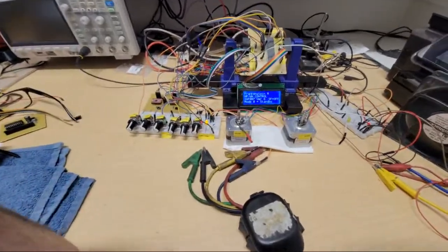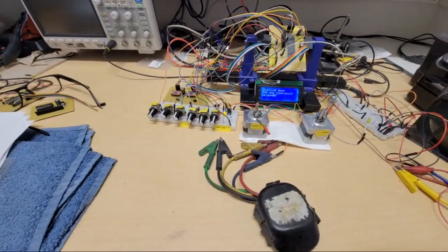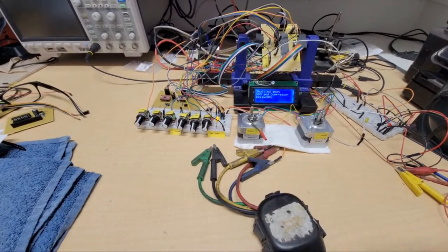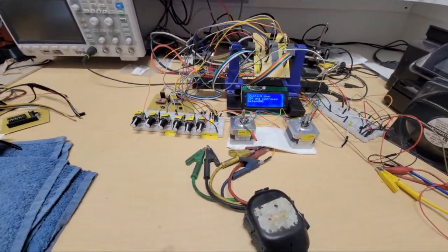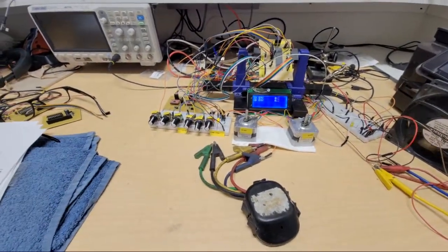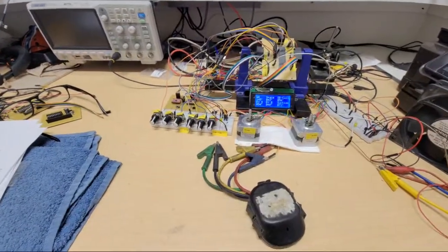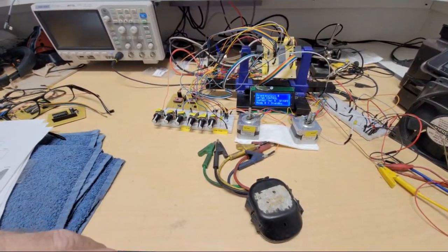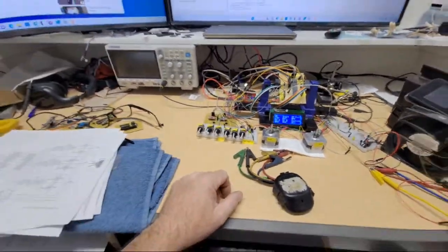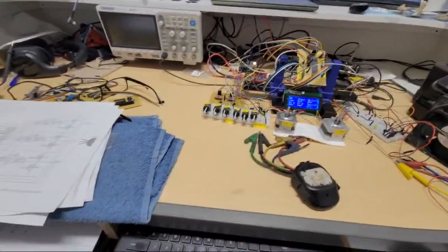I have it also resetting, so it's going to bang them because I just have it home. This is what I have a program for now. I might take that out later and only home them when the power's cycled. If you listen to when you first power up mini splits, VRV units, VRF units and stuff, you hear them close, and then you hear a more pronounced thud right when those little domes, the needle is all the way, it'll shake. And I've even tested that out in the field. Put my hand in there and I wait, and all of a sudden you feel it thump. And then the one I made outside, it does the same thing.